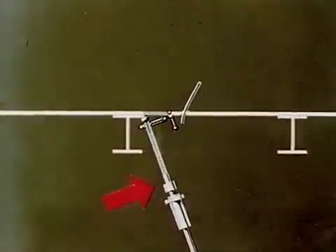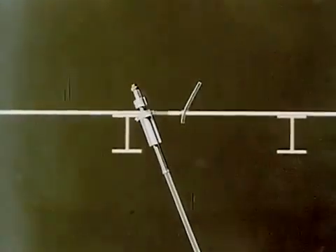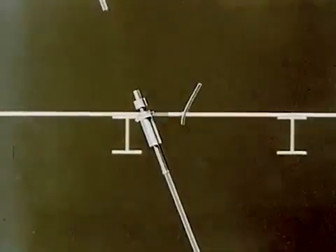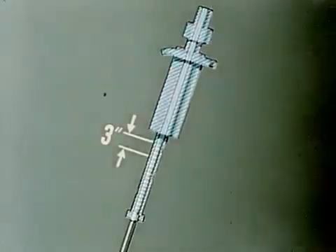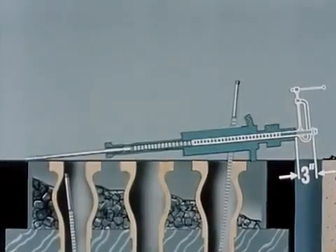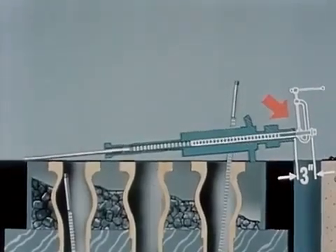The impact also broke the rack inside the plug and simultaneously caused the plug to slip back up the rod to the fully inserted position. The plug flange then hit the overhead structure and the fractured rack continued into the fan room. The plug fell back onto the vessel head, snapping the connecting rod after it had been driven upward through the plug about three inches. The scratch mark evidence and matching marks on the tube and extension explain the seeming discrepancy of finding the central shield plug with the final rod withdrawal position only three inches above the normal zero position.